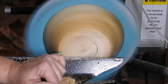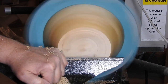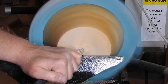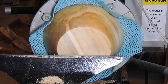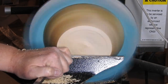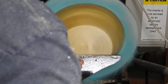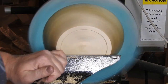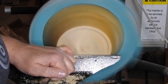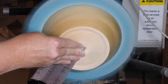In this scene I have the bowl mounted to the cole jaws and I am turning off the bottom of the bowl. Here I am constantly checking to make sure that the bowl is going to sit how it is supposed to while I am forming the foot of the bowl. Now that I am satisfied with the shape of the foot, I can begin the sanding process.